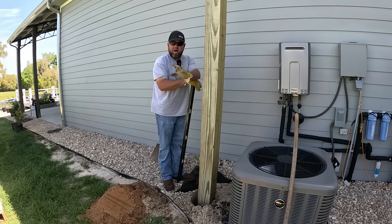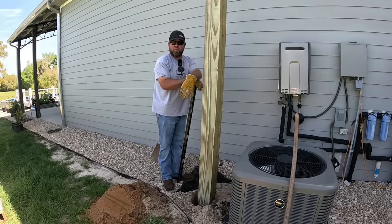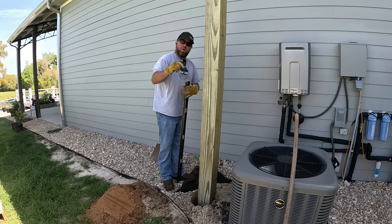I'll pour a bag of concrete mix around this. I've had really good luck with just pouring a bag of dry mixed concrete around a post — eventually it hardens up just due to moisture in the soil or rainwater. I'm going to wet it today with a garden hose so it's firmed up for us to work on tomorrow. A lot of people say you need to mix your concrete with water before pouring, and that's correct if you want a super strong mix. We're just trying to set a post here and add some weight to it.